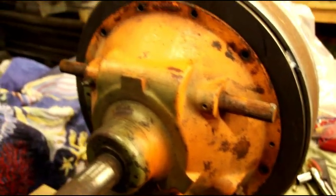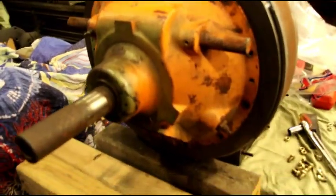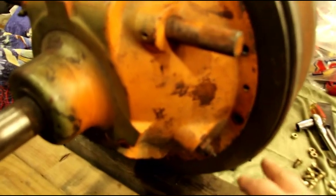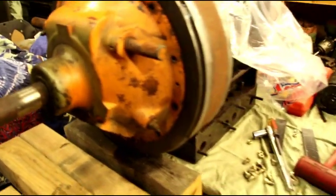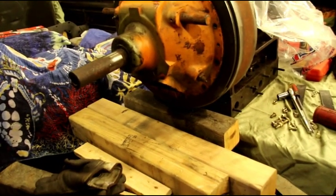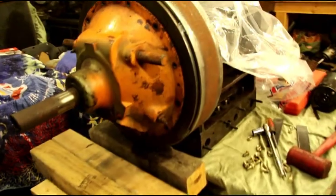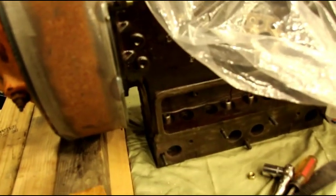Once I get the outside welded, you can see I ground here for a nice clean weld. Once I get it all welded, I'm going to sandblast it. Then we'll come back, we'll put the gussets in, we'll put the slugs in for the starter, and that'll finish up the bell housing. You know, we'll grind it smooth and everything. And then we've got to put a foot on the bottom to pick up a mount. So I'll fabricate a foot for that, and then we can start working on the base and the shroud and everything that's going to house this in the back of the Jeep. But for now, the good thing is we can take this off. We know everything fits. I can put the motor back on a stand, and I can finish assembling this motor.